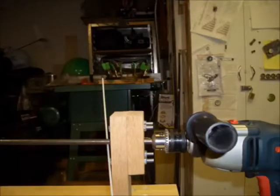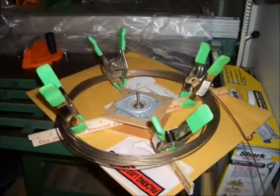The resistance wire came in a loose coil about a foot in diameter. To make sure it would feed freely to the coiling jig, I built a turntable from a yardstick and a lazy susan bearing. I centered the coiled wire on the turntable with clamps. During initial setup, I found that the lazy susan bearing allowed the wire to uncoil due to its springiness, so I flipped the turntable over and let it rotate on the cardboard underneath. The friction between the turntable and the cardboard was enough to prevent the wire from unraveling itself.